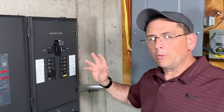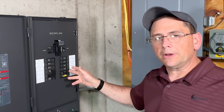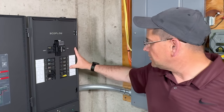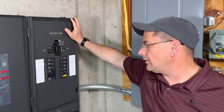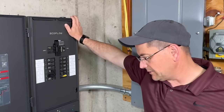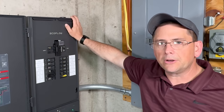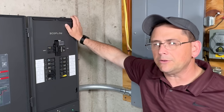In my next video where I showed me installing this, I actually measured inrush values — the heat pump actually pulls about 52 amps for an instantaneous second. That's where the inverter system that can run 10,800 watts for 10 seconds is able to handle that kind of load. You can also add a hard start or soft start to your air conditioner to make that starting amperage lower. But keep in mind: my heat pump pulls about 2,000 watts, and with this battery being 6,000 watt hours, I could only run it for three hours — assuming I don't power the furnace. If you're wanting to run a dryer or electric water heater, you're going to drain it really quickly. Mini splits are much more energy efficient and inverter-based, so you can get away with quite a few different things.